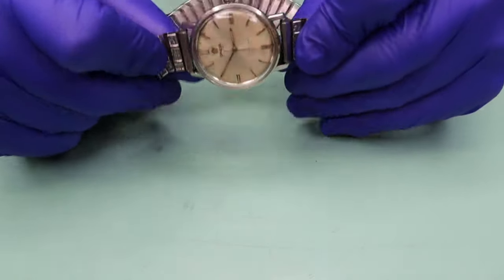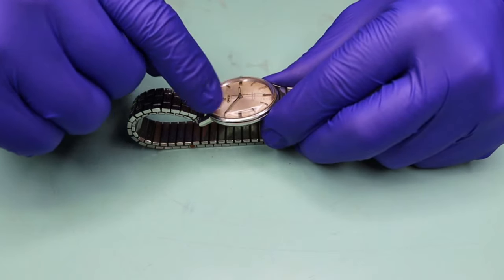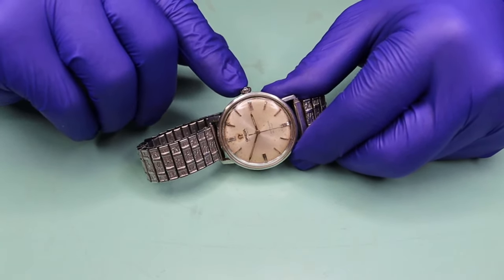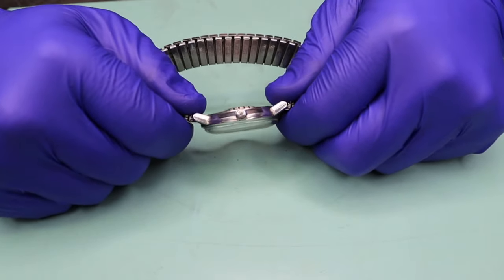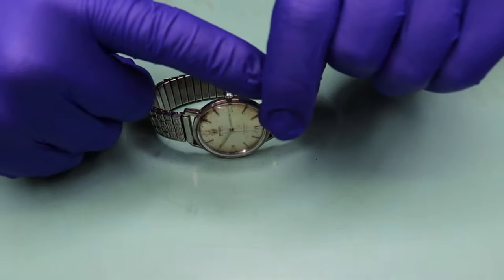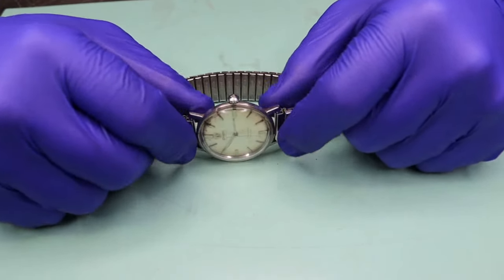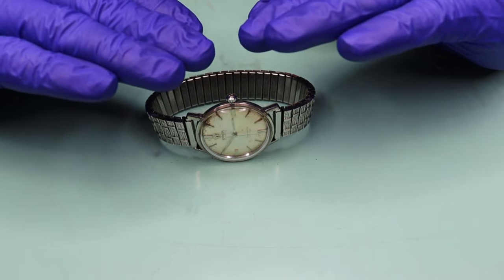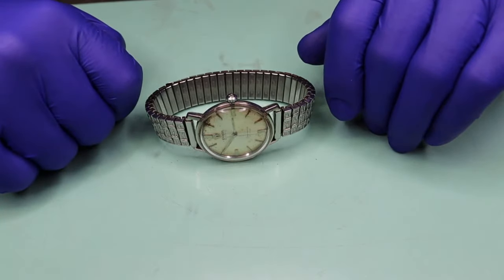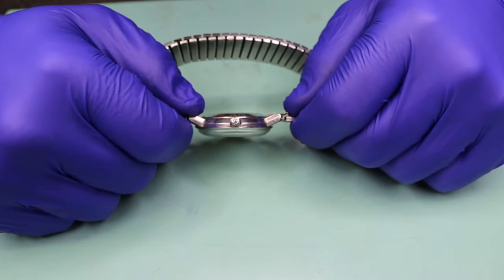It's completely solid. So you pull this bezel off with the crystal, and then there's a little locking spring, usually a rose gold or copper color, that you slide. First of all, you want to release this split stem crown, and these are notorious to break. There's a male and a female end to these stems. Usually the male end is on the movement and the female end's on the crown, like a little two-jaw with the male end that goes inside. I like to take it off with levers so I can evenly distribute the prying pressure. That's what I found works best, because it has to be even on both sides or you'll break off one of the teeth on the female side. So why don't we do that first, and then we'll begin removing the movement.